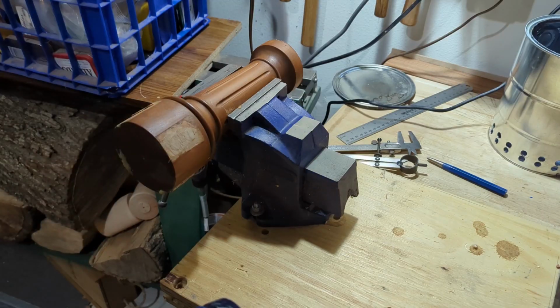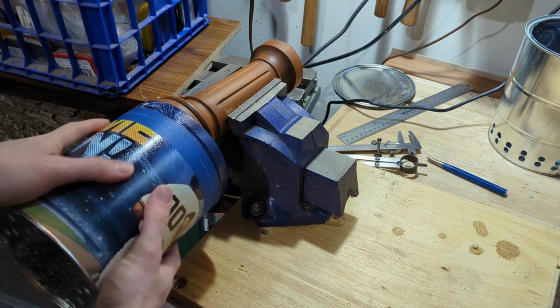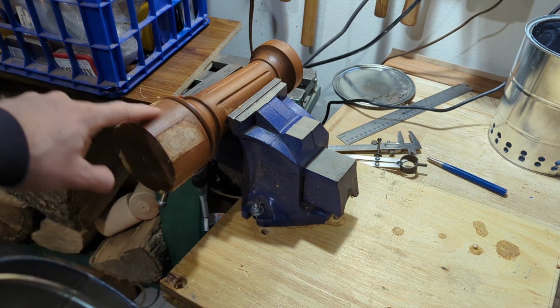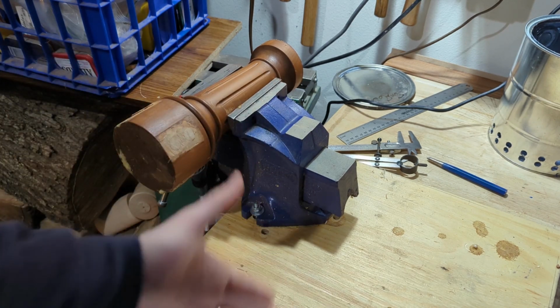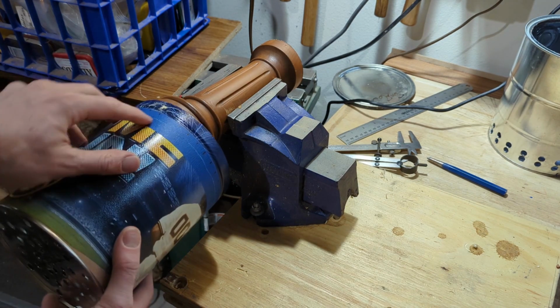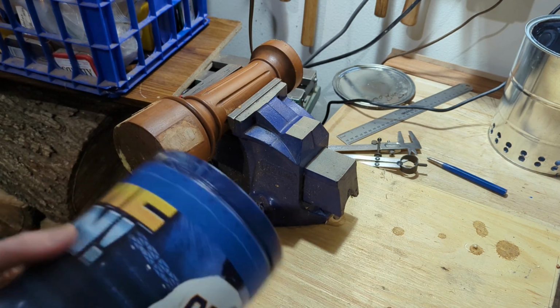All right, so hopefully the heater in the background isn't too loud, but this is my setup for punching these holes that are going to be used to pre-drill. This is just an old post out of a coffee table that I snagged all the wood from, that I clamped up in a vise that is clamped up in my other vise. This is an interesting tip. But anyway, what that does is it gives me support behind this as I tap it. Otherwise, it just deforms this thin metal.